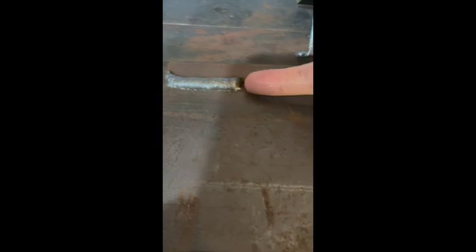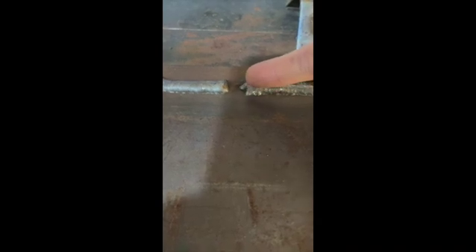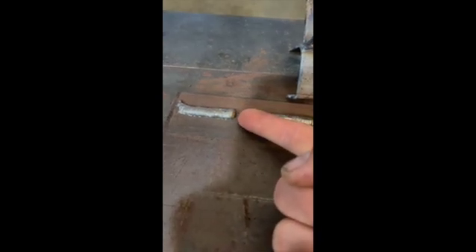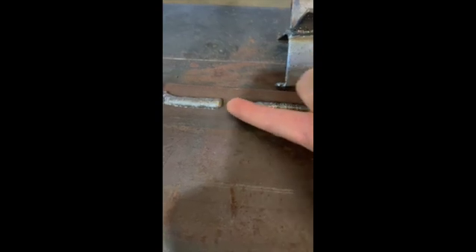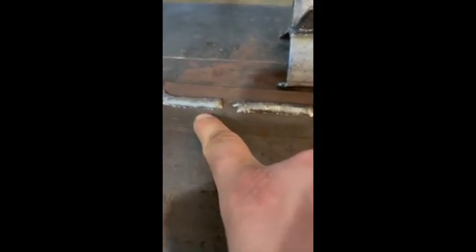That's something to expect with these little welding machines. You can still apply the technique of oscillating the arc back and forth to increase preheat, but those arcs are quite small and therefore the preheat isn't really enough to allow that puddle to tie in. You don't have enough current and thus not enough melt-through. Ideally, a bead like this should look flatter — instead this one looks taller and there's a lot of lack of fusion.